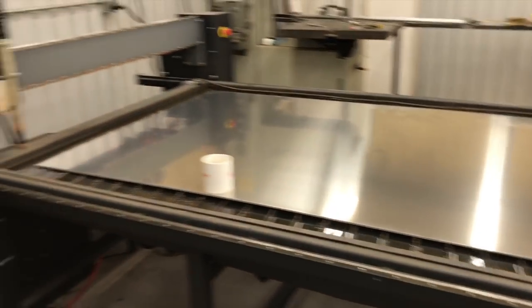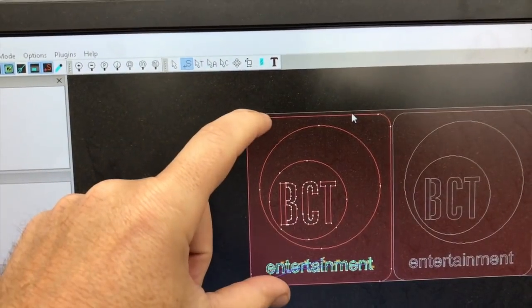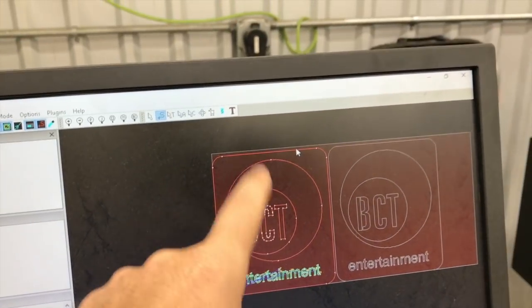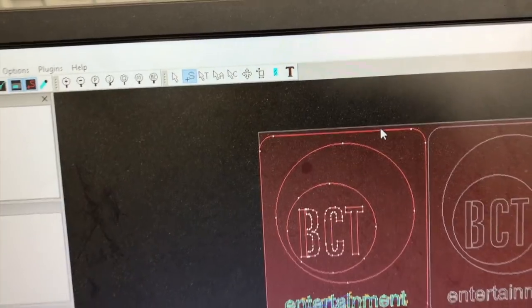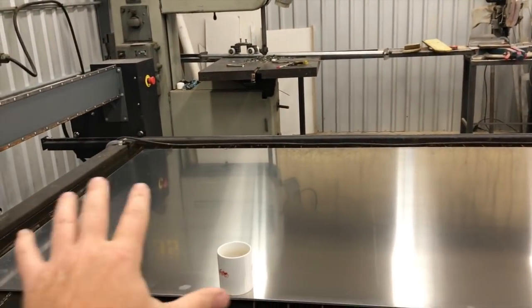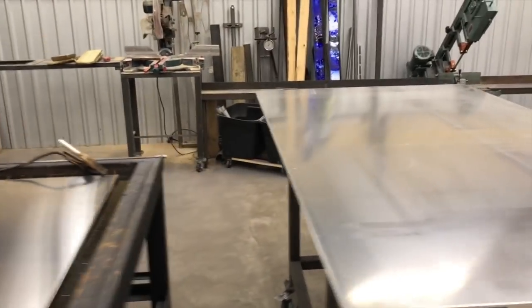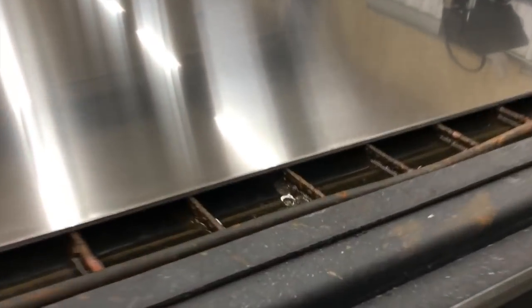And so the first thing is, can you talk your customer into letting you tweak the dimension? Now this is a 48-inch sign, and the customer has allowed me to go 47 inches, so I have an inch to play with top and bottom. But at the same time, when you're cutting out something that large, a little plate offset, something not exactly square, could definitely be a problem. So that's the first thing: do you have your plate loaded in a square way?